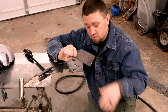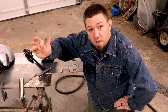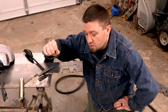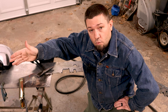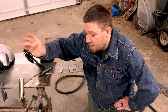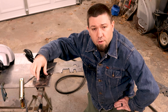I have cut with a guide — in a previous video I was cutting sheet metal with this cutter and it did pretty well. I used basically a four-foot level as a guide with some clamps, and it cut really dang straight. This is me not using a guide, not taking my time — this was just a demo to show you how well it can cut on 220. Up to 55 amps, set on my new 220 line, it's not breaking a sweat. No popped breakers. The machine is working great. I don't know what the problem I had with it was, but I will update you guys if I continue to have trouble. For all I know, I had something connected wrong.